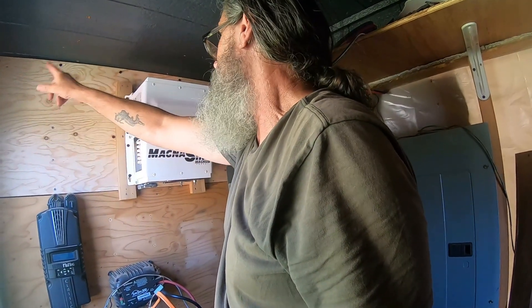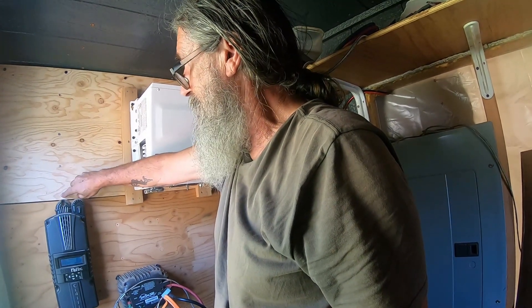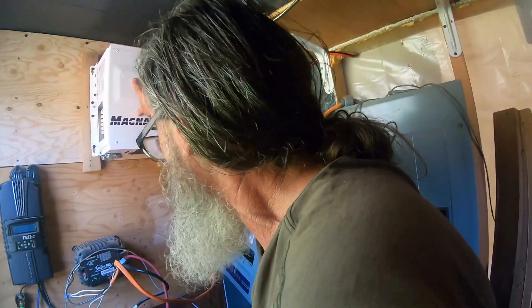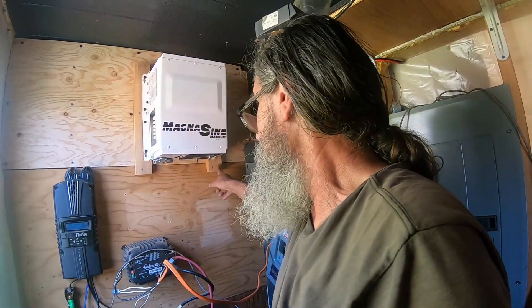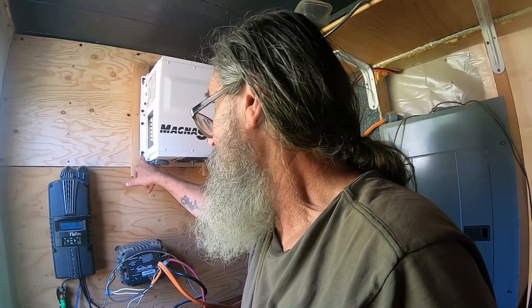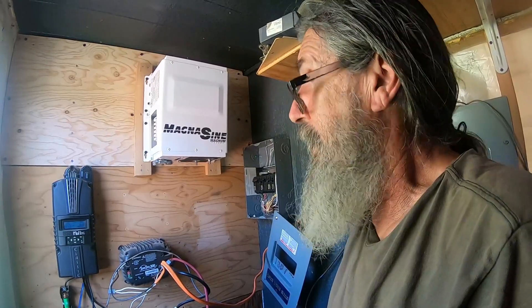One, two, three, four, five on the top, two on each side, and then I screwed into the studs — four screws in each stud going all the way up. Then these supports here — I still gotta finish the bottom — six screws: two on the bottom, two in the middle, two on the top on each piece of wood, going straight into three-quarter inch plywood. And this has eight timber locks going through it into the plywood.